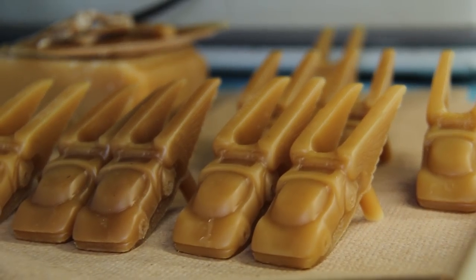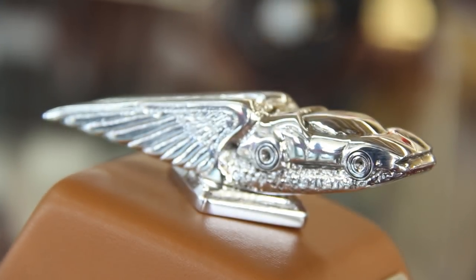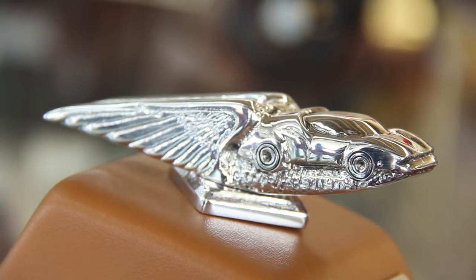Today we have something pretty exciting because what we're going to be doing is showing a very interesting process called electroforming. Basically, this derives from plating, and what we're going to do is take a wax mold of our original piece that Kalev had made of a trophy, and we're going to then plate to it so that we can build up a nice metal outside in copper. And at that point in time, we can take the wax out and we'll have a perfectly formed little thing, only using the electroplating process.